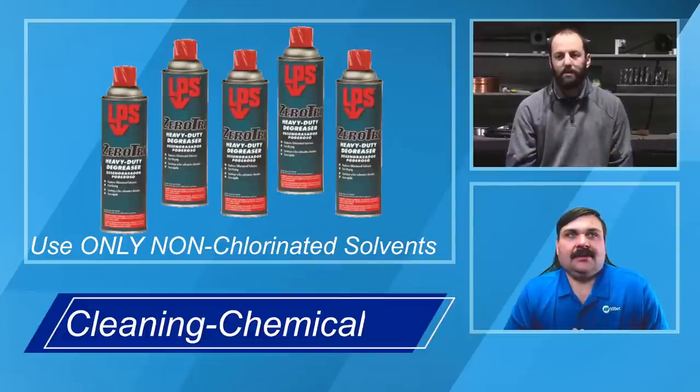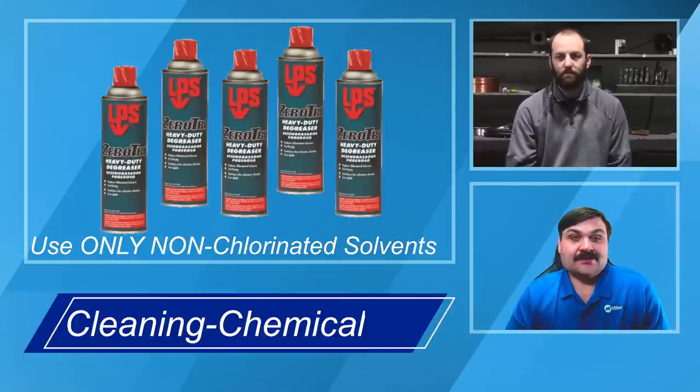Yeah, so you're adding in more moisture, and chlorine aside, a lot of times those have ammonia in them, so that's another chemical you don't want to be burning and breathing. There are a lot of different ones out there. One of the most common ones that I see on the road is acetone, which you have to be careful with because it's also a hydrocarbon base. So you want to make sure anything you clean with that is dry and that anything you're trying to get off the surface, any grease, is completely broken down and gone before you try to weld on it, because you might be making it worse.